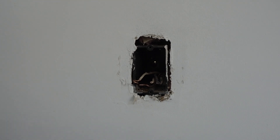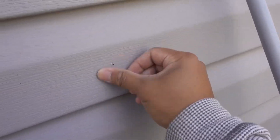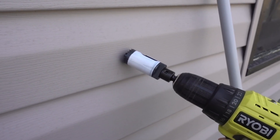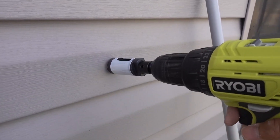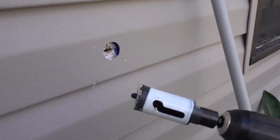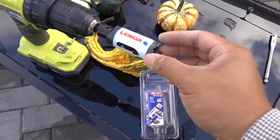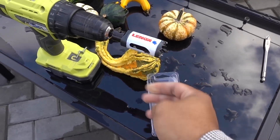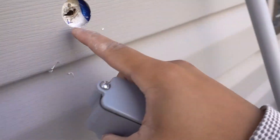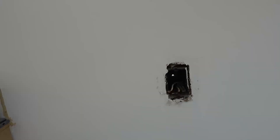Do you guys see light? So I'm going to go to the other side now and finish from the other side. Here's the tiny hole that I drilled in just now. I want it to be as minimal as possible, so that's why I'm stopping here and I'm going to go get the hole saw that I bought earlier. I'm going to put the pilot hole straight up to here as close as possible. Here I'm just trying to cut the siding, so I'm going to cut as slowly as possible. And well, that was quick — siding is literally like a sixteenth of an inch. I'm going to cut into this insulation a little bit with the hole saw and I just finished cutting that hole.